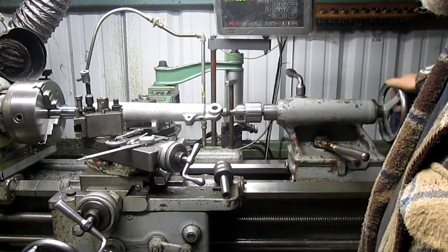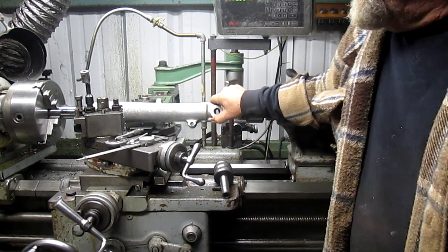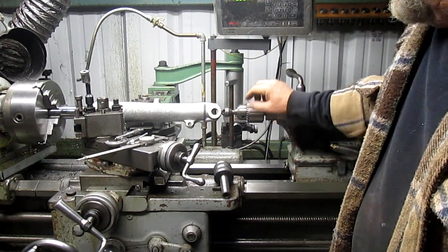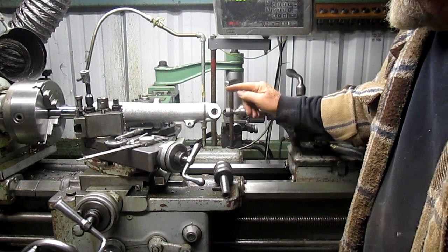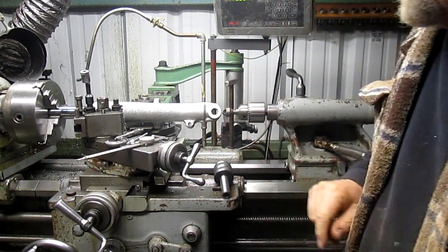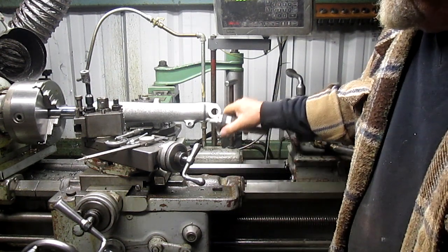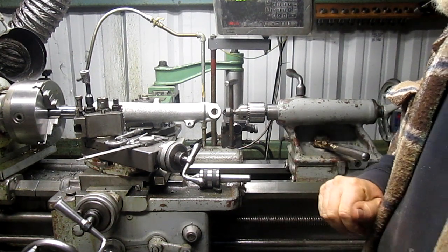We've put the tube on the actual shaft that it rides on when it's being a shock absorber, and we've kind of bottomed it out, and it's just slightly tight. And now we're going to run pretty much a deburring tool in there to get a pretty consistent I think that's 60 degrees, it might be 45, but whatever it is, it'll give us some kind of consistency. And then we'll be able to come in and hopefully put a center in there and get that thing to flow somewhat evenly. So we're going to crank it up.